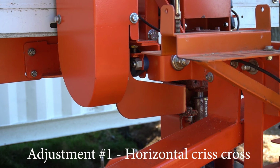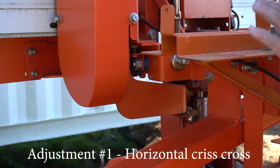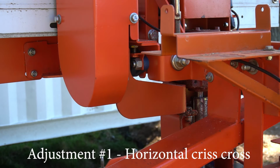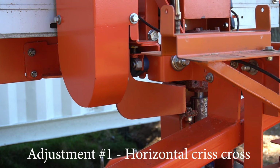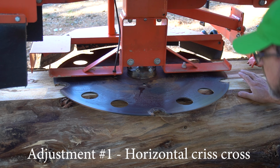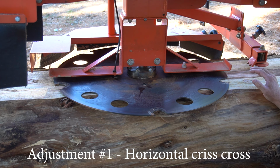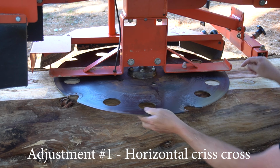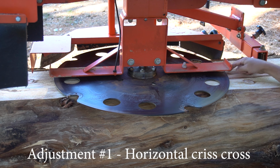and back. So what I can do right now is I can physically push the machine onto the slab and check that on the slab face. So it's best to actually push it on when the machine's switched off, then it won't score up your slab. But right here, so I can roll that tooth over to the front here. I can look at the gap, and at the moment, it's scraping at the front.